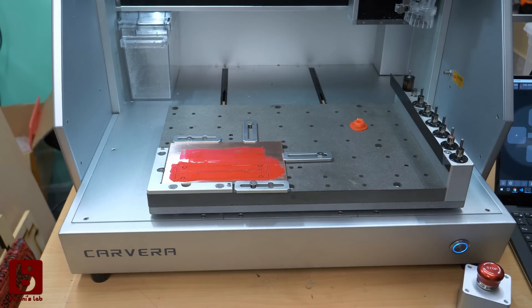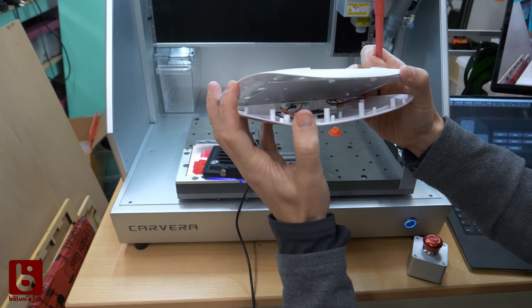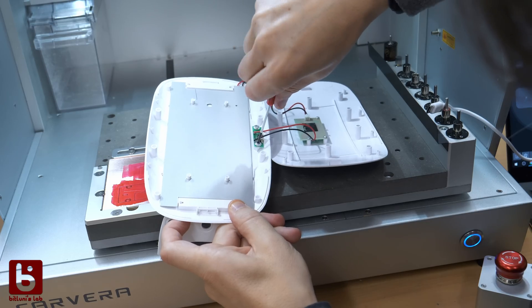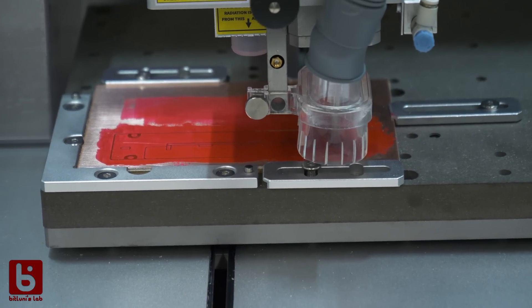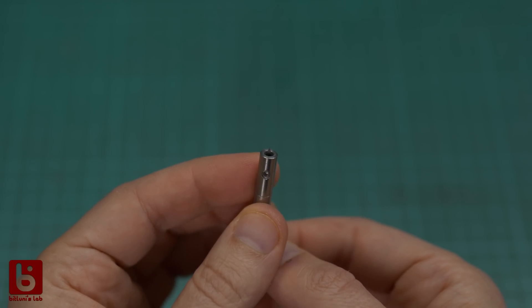I need to repair this. I replaced it with another UV lamp I had for curing resin prints and repaired the broken USB. I completely ripped the pads of the PCB. What I learned here is to rather use thinner layers for it to cure better. Next step is to clear the pads from the solder mask while keeping the copper intact — that is done with a spring-loaded bit, which I had never seen before.